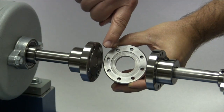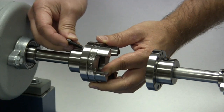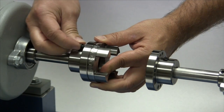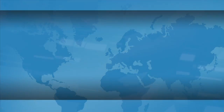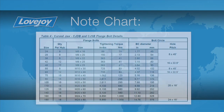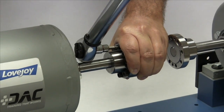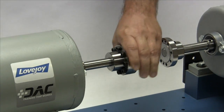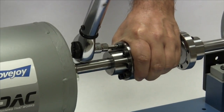Place the jaw ring against the rigid hub. Notice the ring is piloted to the hub to maintain concentricity. Insert the bolts from the hub end and hand tighten to hold the ring in place. With a calibrated torque wrench, tighten the flange bolts to the torque specified in the chart. The bolts should be tightened using the industry standard procedure: a criss-cross pattern starting at 50% of the specified torque, then 75%, then the full torque. Double check each bolt after all have been tightened.